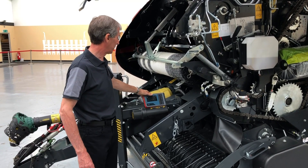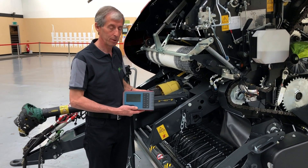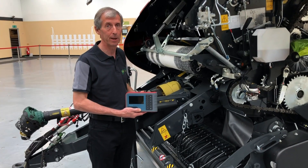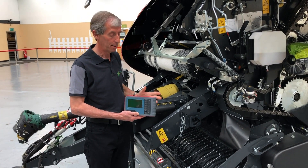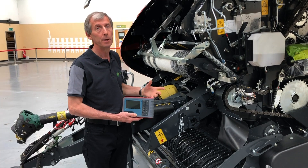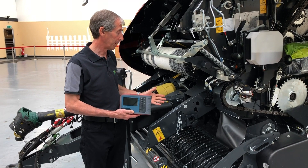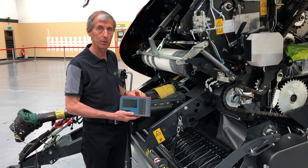Looking quickly at the control system, there is a Focus 3 terminal with a colour screen. All the main baler settings are controlled from this screen: bale counters, bale density, net quantity, automatic or manual operation, and selecting the pickup drop floor knives — all done from the control box.